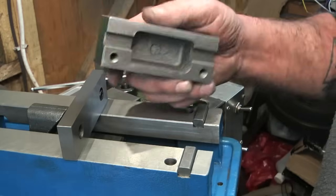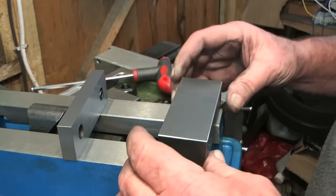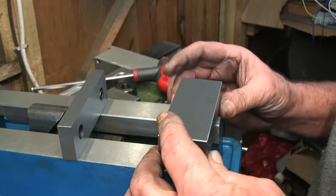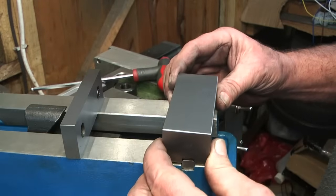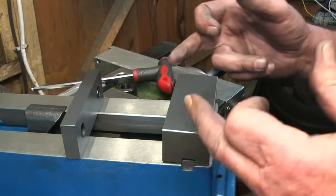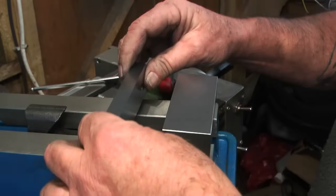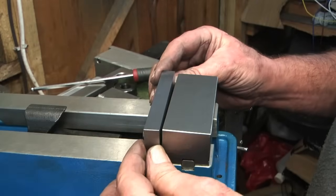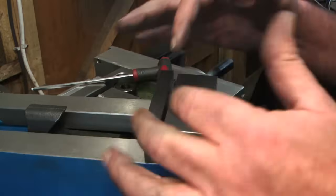So with that said, when it's screwed down, it is a good fit. That's not down at the moment. It does need pulling down in. It's got end float this way on the bolt holes, so I need to think about getting it central. And much the same when I bolt the jaw on, this has got end float in the bolt holes as well. So I'll just try and middle it all up as I put it together.